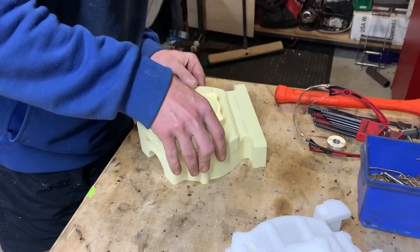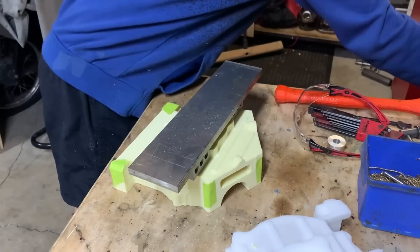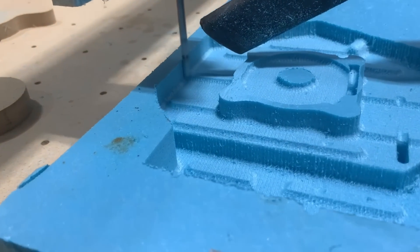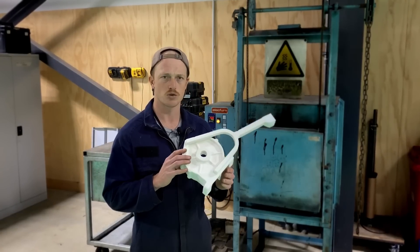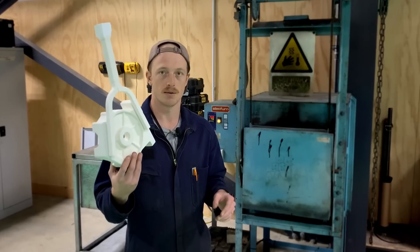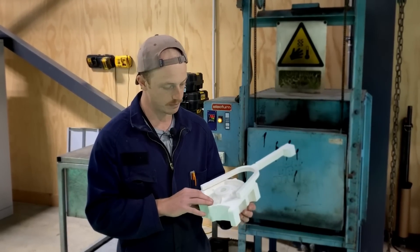The reason I made this was to test out the router before using a whole sheet of foam, finding the perfect recipe for speeds and feeds. I did learn the router would lose steps if I went over 2.7 meters a minute — that's due to running on a 24-volt power supply, so that can be up to 42 volts in the future, although the owner isn't really that fussed about the slow rapids. If you want to know more about this V-twin engine I can do a whole other video — just make sure you like this video, it really helps out and lets me know you enjoy the content. If this video gets a thousand likes, I'll do a full build breakdown on the parts I used, why I built this, and what it is.